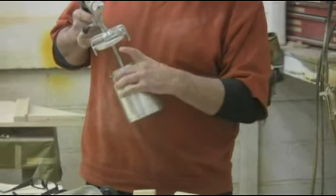But what we've got is this air exchange is pumping more air in than the fan is pulling out. The reason for that is we have a dedicated booth. But here's the thing. If we just close this room up and turn that fan on, every crack, corner, crevice is just going to be sucking dirt right through it. And even if we have a wall that has all kinds of filters in it, it still is going to pull dust and dirt from the outside.